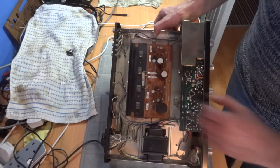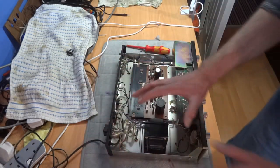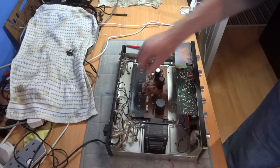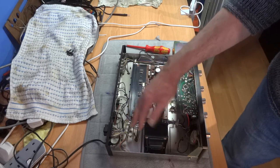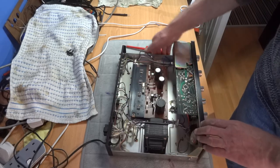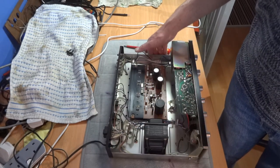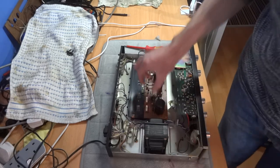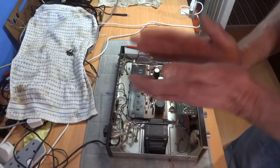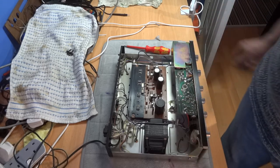Make sure everything is unplugged. You could also check the fuses — make sure they're not wobbling in the holders. Any fuses that are sealed here you can't really get to, so leave them. It's nitpicking really, but if you've bought a second-hand unit and someone's changed the fuse a few times, the spring in the holder can go. Cleaning the controls is a later video.